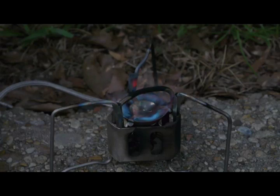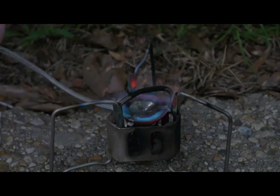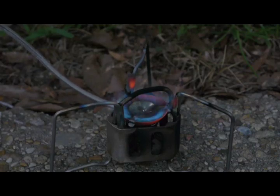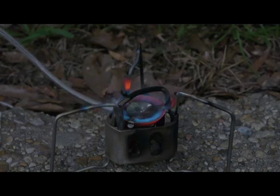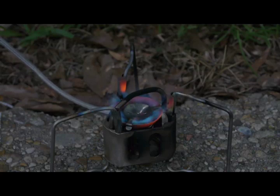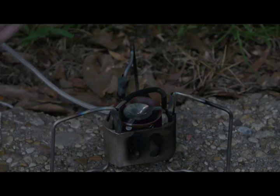And now I'll go ahead and shut it down. Again, elevate slightly the tail end of the bottle and elevate the line so that you completely flush out any kerosene that's in the fuel line. This should take a little longer to bleed off compared to the 37, as you might expect. That's pretty good. That's pretty good.